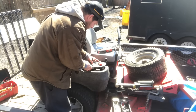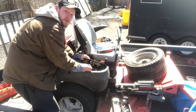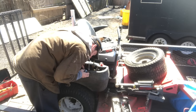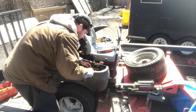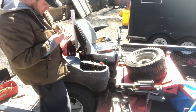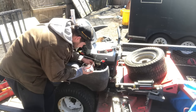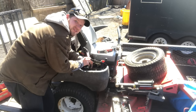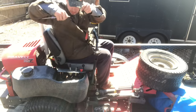So this is what we're after — this ignition switch here. There should be some markings on the back, some labels. This one's gonna be a little bit tough to see — she's all cruddy — but just on the back of there. I'll check for power up here. There's battery, there's a seat safety switch probably on this, that's why I'm up here.